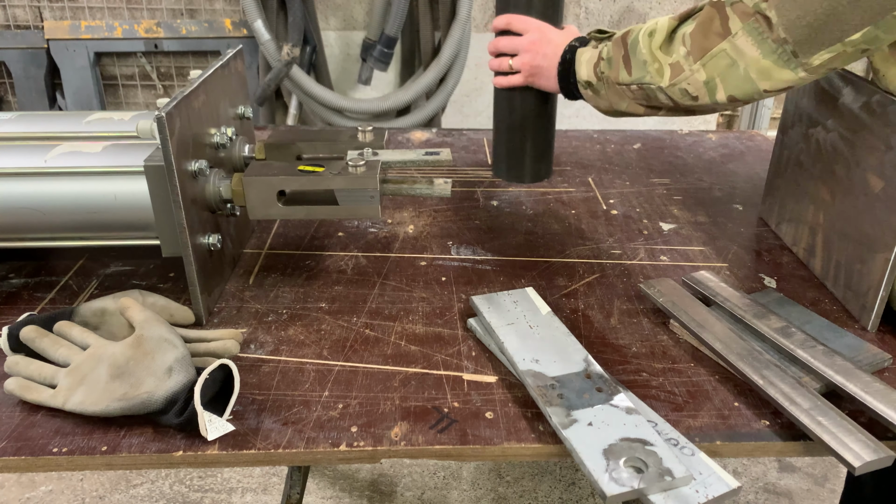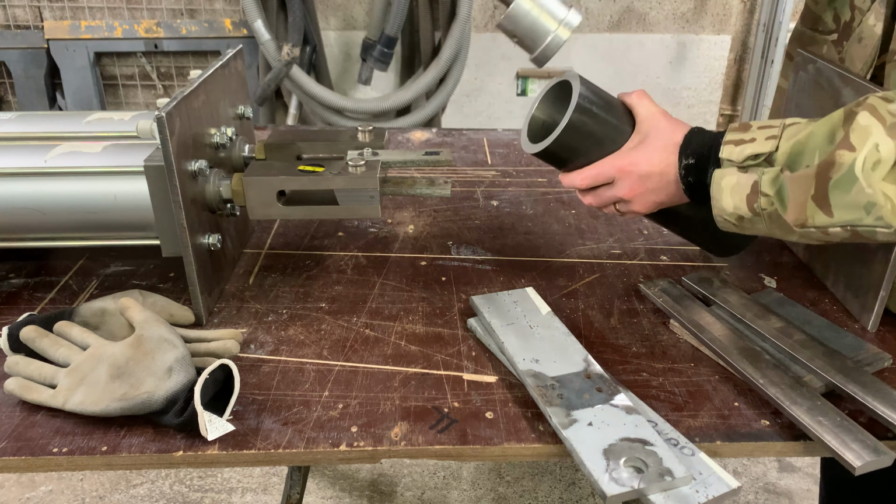But basically, that will push down into the cylinder that's filled up with the mashed card onto this plate. So it'll be sitting something like that. Now, what I want to do is try to eject the core, the squashed up cardboard, after it's been compressed. I've got enough stroke in the rams, hopefully. There's 450 mil stroke. So the idea is, on this base plate, I'm going to have a little trapdoor. This plate is going to be mounted on the back of this plate.